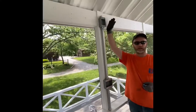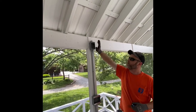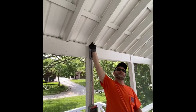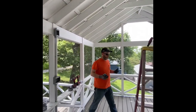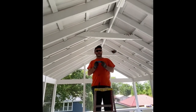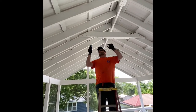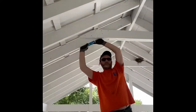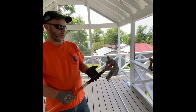She wanted an outlet up high — not against code — so she could have Christmas lights and everything. I'm going to come out of this box and bend an angle to get up and over to my box, and that is what we call a compound 90. I need to know the pitch of the roof, so I took my level, put it up against the stud, and the 30-degree level is right on there — so I know it's a 30-degree pitch.